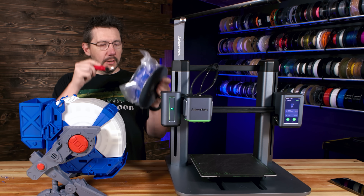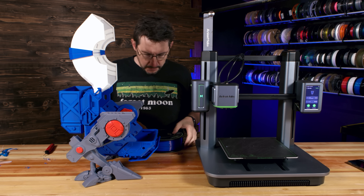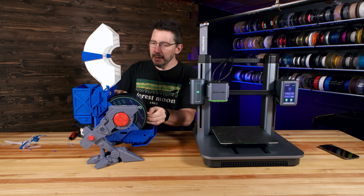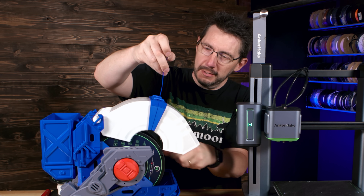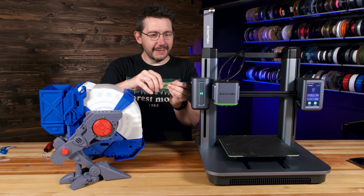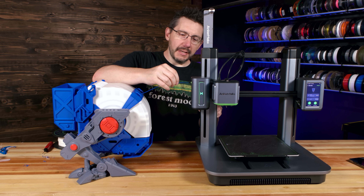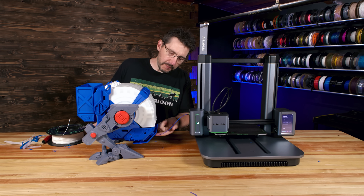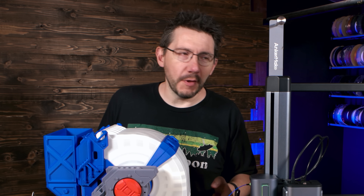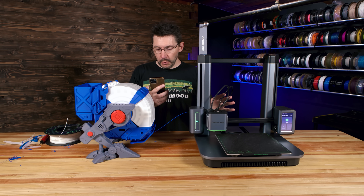For this, I've got the white unloaded. I think what I'm going to do is print in blue, because come on. Let's see how loading goes — lift this up and it stays up. Here's the bar. It looks like the stress on the plastic is causing it to bend inward just a little bit, so I can put it through right there, and it spins. I did realize the error in my ways — I loaded the filament out from down here, which is where it's supposed to be. The machine has the latest firmware, which I just found out was out, and now I can print something.